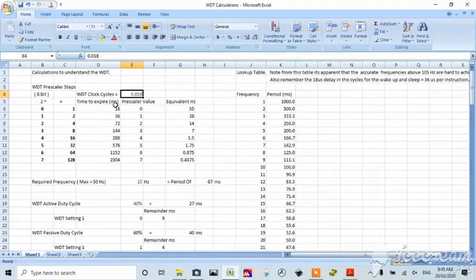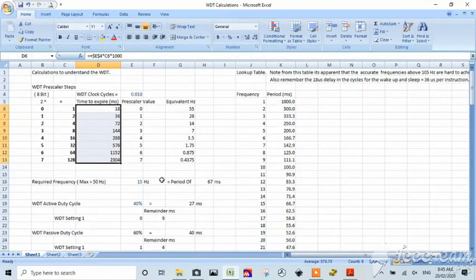Alright, let's swap cameras. Multiply this by this value. Here's our 18 milliseconds, here's our 18, right? So these are the milliseconds we get. So one cycle becomes 18, 2 cycles becomes 36, 4 cycles becomes 72. Now these are the cycles here, right? So 2 to the power equals the cycles. Here they are, and here are the milliseconds in here. So then it becomes pretty simple. This is just a calculation.